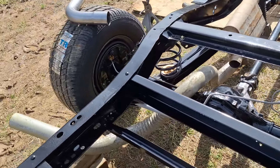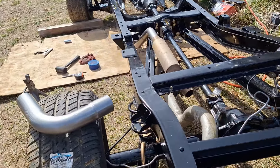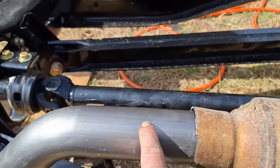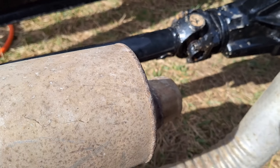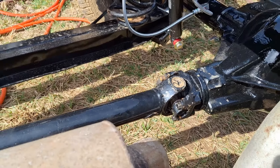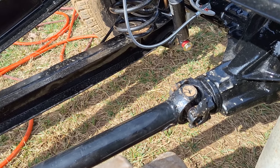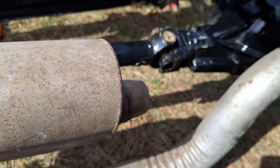It's going to be a little tight and we'll just have to see with the suspension. I'll probably need to cut this 45 here a little shorter because my bend on my tailpipe is getting close. I don't have but four 45s altogether, and this pipe right here would have three or four — there's four or five 45s in this one pipe if I remade the whole thing.